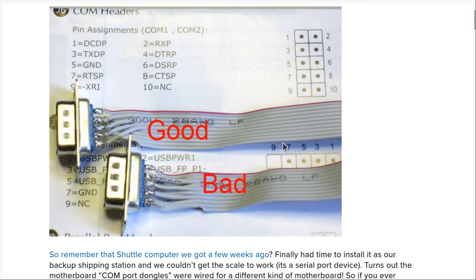1, 2, 3, 4, 5 in this order, and someone tells you to connect the wires in a ribbon cable to a D-sub connector over here, like a 9-pin, you might be inclined to do it as drawn up here if you're going to do it by hand and waste tons of time pulling all the wires apart and soldering them on this way. And the reason you might do that is because on a D-sub connector, this up here is pin 1, 2, 3, 4, 5 in that order, for a male connector in this orientation. That's how they would be numbered, okay?